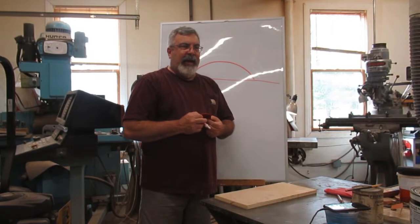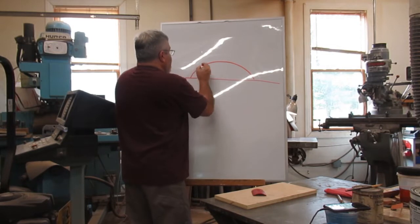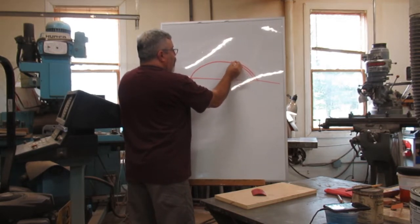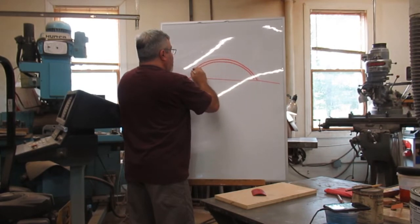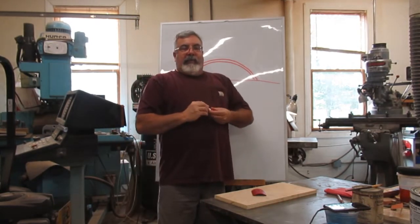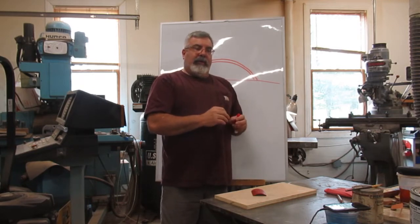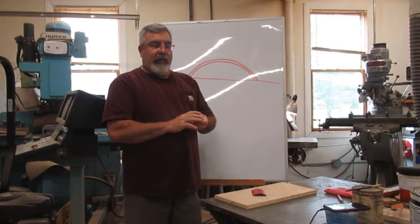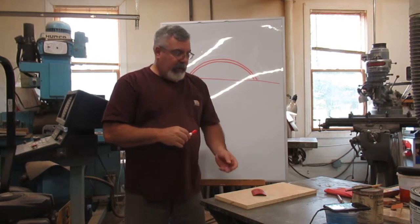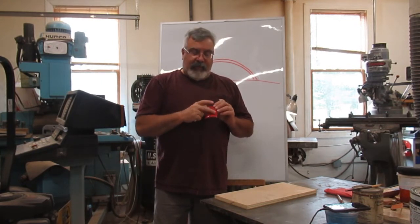I think I made it 5/32, so a little bit bigger than 1/8. Especially with aluminum, it's good to pour a little bit heavier than 1/8 for a sand casting. If you have a permanent mold, or you're heating up the mold it's going into, it'll come out a little bit better. But for sand castings, 1/8 of an inch is about where you're going to be with thickness on a lot of stuff. It's like smaller stuff too.